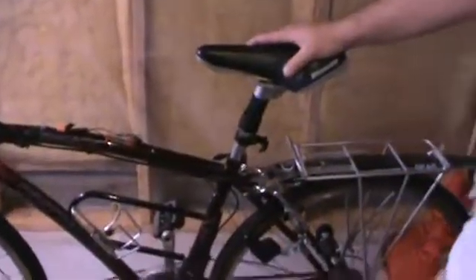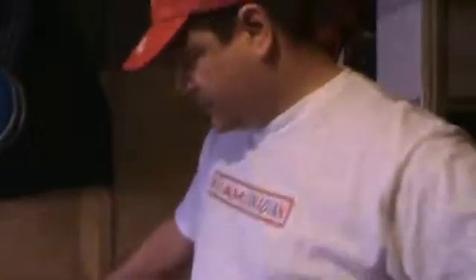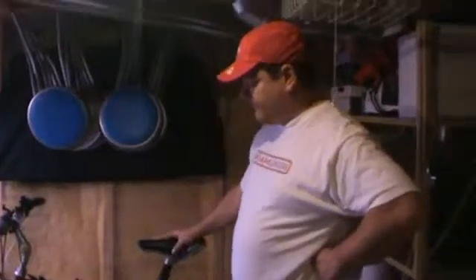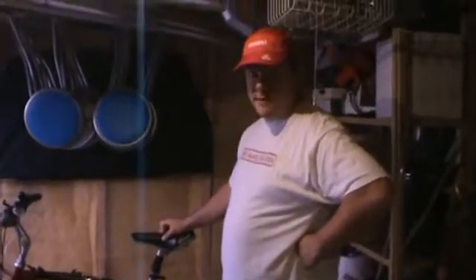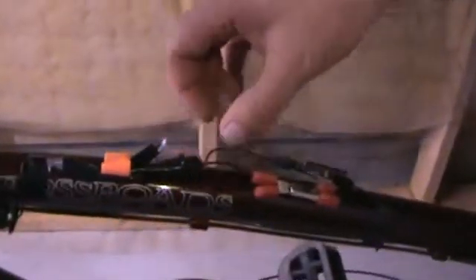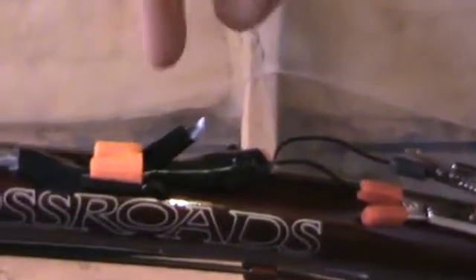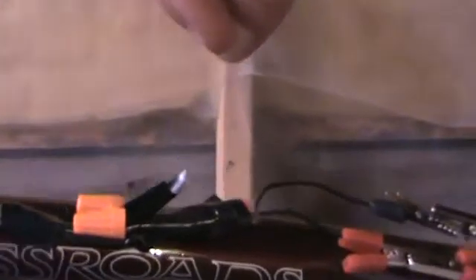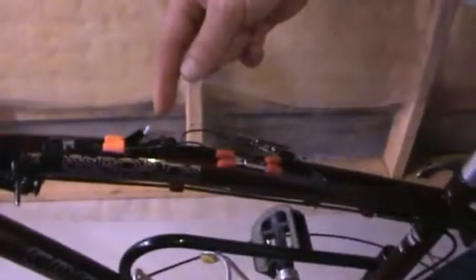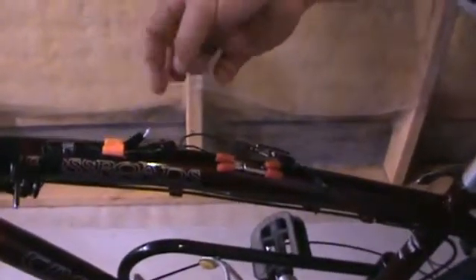I found the dynamo without a problem. But when I did my testing, I found that as I ran the dynamo, it ended up generating AC voltage and that's not good. So one of the things I found on Instructables was a voltage rectifier. In this assembly — you see the schematics on the webpage — there are four diodes that basically take the AC voltage coming in from the dynamo and rectify it so it's pure DC voltage.